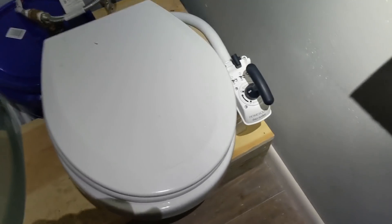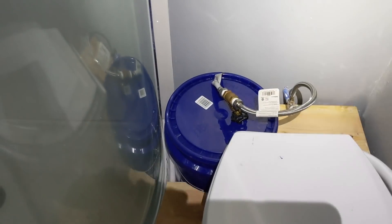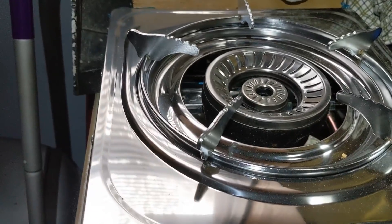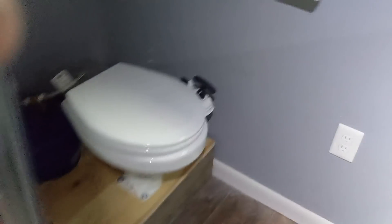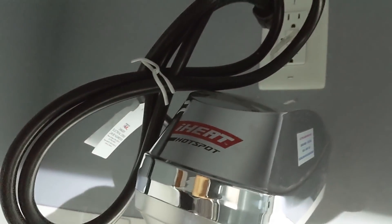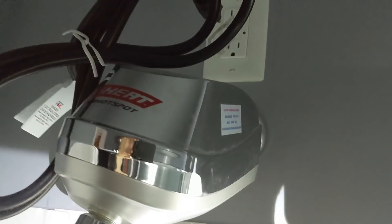Here's a cool off-grid idea — it's a home biogas toilet, a biotoilet. You get it started with some cow manure and let it go. The gas is plumbed over to the home biogas burner. This is awesome — I want one of these because I got cows. The other thing here — which could work in a pinch but uses a tremendous amount of power — is an on-demand shower, 110 volt, pulling about 23 amps. It's an on-demand water heater for a shower, 115 volt.